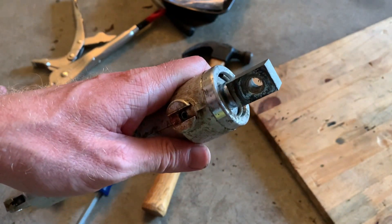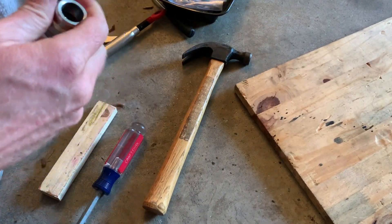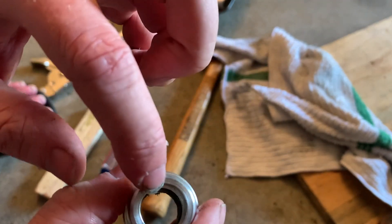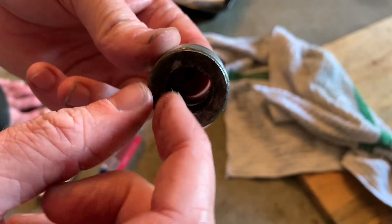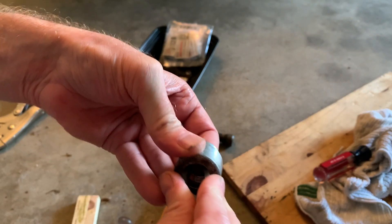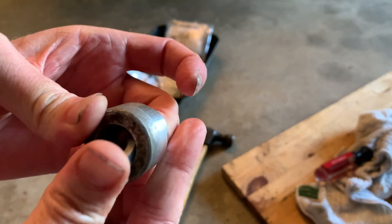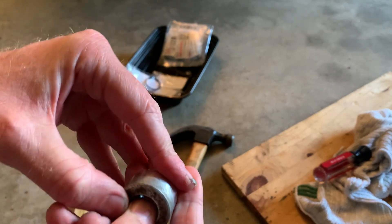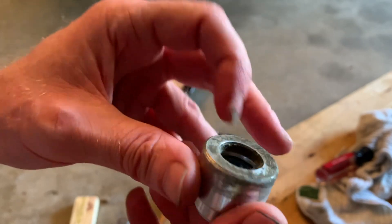In the main lift part we've got the big O-ring. Seems like I have this cylinder rebuilt now. When you're putting on the seals that go inside this thing - you can't push in from the bottom, you've got too much wall to work with. Push in from the top, hold it in with your finger on the bottom into the groove on one edge, and just push as hard as you can. It'll pop in there eventually. Push it in, hold it with your middle finger since the pointer nail is broken - just push really hard, don't worry about kinking the seal a little bit, and just like that it popped into place.